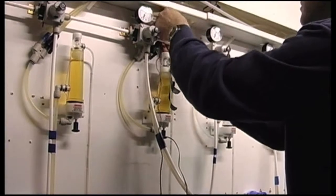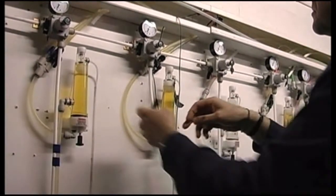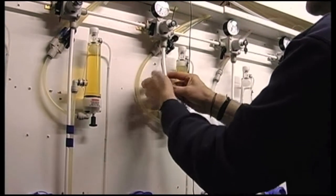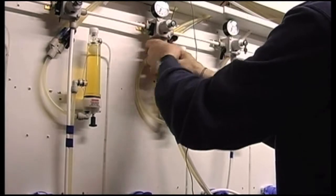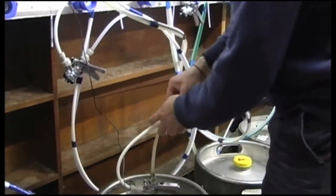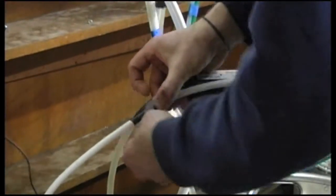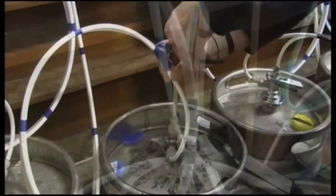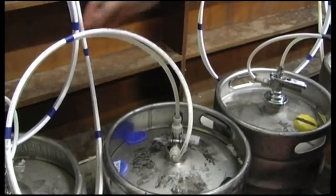The electric wire attached to the BeerTech conditioning unit is then uncoiled and is carefully pulled and taped between the gas and beer pipes. This also ensures that they cannot be snagged when changing or cleaning the pipes. The wire is constantly being taped safe till it reaches the beer line trunking above. Again, this process is carried out before attaching the wires to the distribution block, thus making sure they will reach without extending the wire. If, however, the wire does need extending, colour-coded wires should be used to avoid damage to the unit. Each unit has a white marking running down one of the wires, which is positive or live connection.